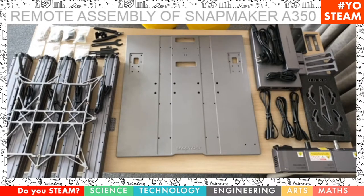Behind that we have all the tools that came with the machine, the screws and so on — everything super well organized in little bags with the name. The only one that didn't come with it, which I mentioned in the last video, is the one that measures the thickness of your material, which you need to know in order to focus the laser cutter properly. But almost everyone has one of those at home, and if you don't, you totally should.